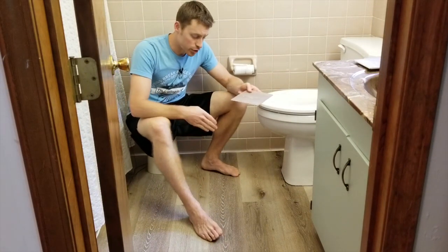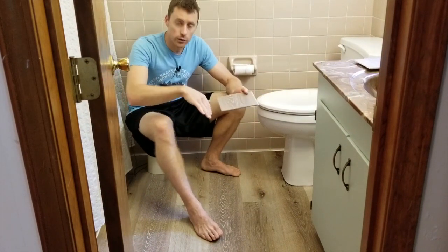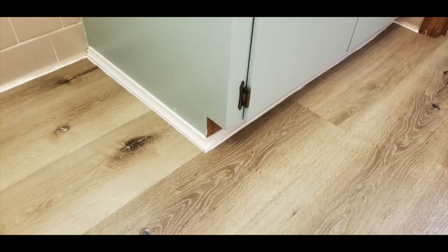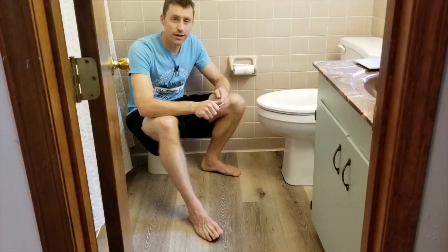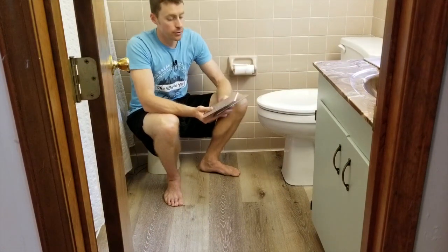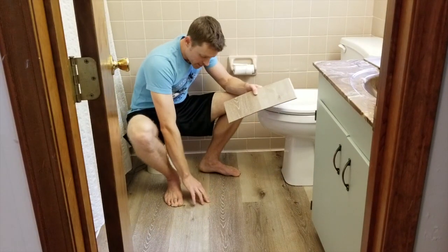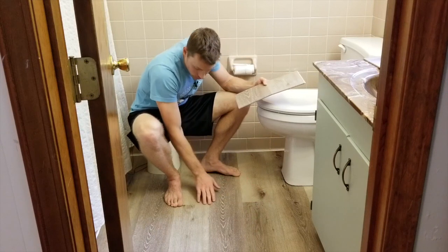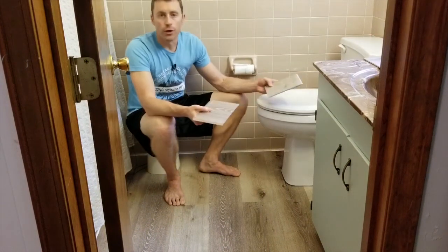What I realized after the fact — maybe I just should have gone this direction instead of this direction. This was my first attempt; I went lengthwise. Making cuts like that, getting around my tile, getting under my door jamb where you have to trim some angles — I found that to be pretty difficult. When you get to the end of your row and want to trim a little bit, you can score it with a utility knife and then snap. That's pretty easy. The product snaps together — you align two pieces and snap down. You'll notice the seams are very tight. I cannot imagine any water getting into these seams. It almost looks like one piece when you have it all together.